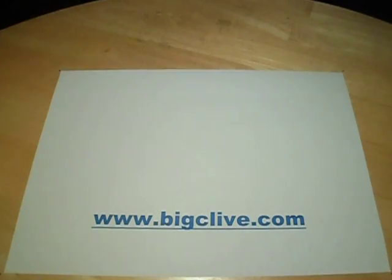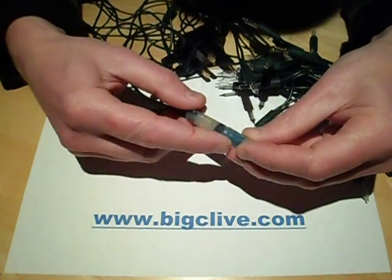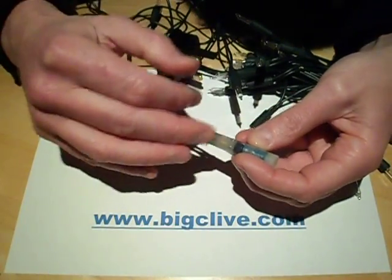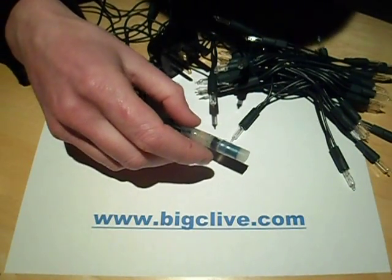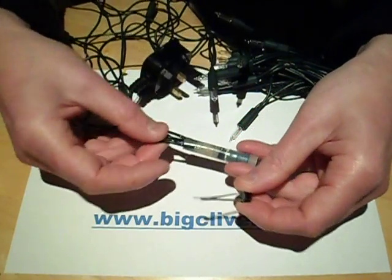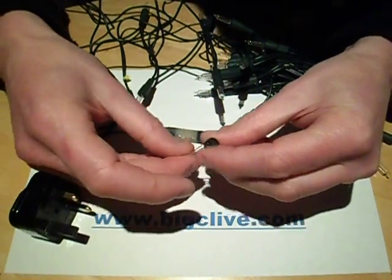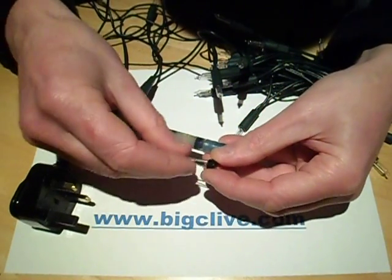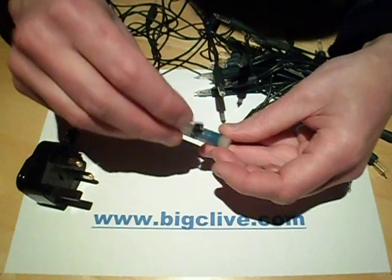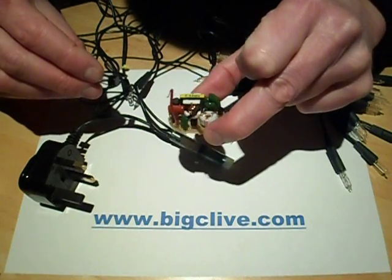Let's take a look at the circuit and the actual module I've built. I've used the electrolytic in this one. The mains supply comes in through two resistors soldered onto the bridge rectifier. The bridge rectifier has four leads, and there's a 10k resistor soldered on each lead. The mains goes in via two of those 10k resistors, and then after rectification, the capacitor sits across the positive and negative of the rectifier. Then two more resistors go out to the LEDs. The capacitor value was chosen purely because it's what I salvaged from a compact fluorescent lamp ballast.